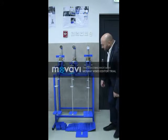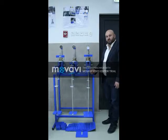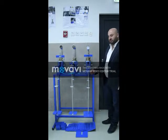The weight is still not exerting on the sample because the arm here is not released. There are three tests that we have to do. The weight can be either two kilograms, then four kilograms, then eight kilograms — or four, eight, sixteen. The increment is always double; we always double the weight.